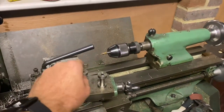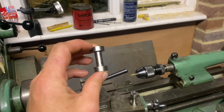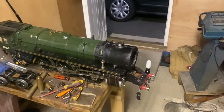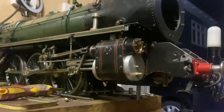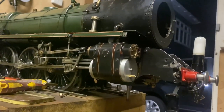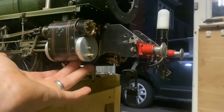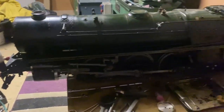Close to the end of the day: I've got the two valve bobbins almost to size in both directions and the right length — they just need the heads put to size and to diameter. I've put the lubricator back in and the bogie stretchers back in, so that's ready. The last thing to go back on is the bogie. I'll get the valves in, run it on air, and check the timing by the ports for the drain cocks. All the other sides are back together as well, so we're close. Tomorrow I can finish those valves, reset the timing, and we'll be good to test-run on Sunday.